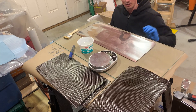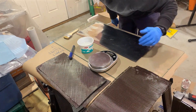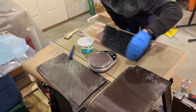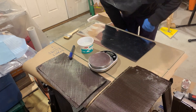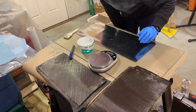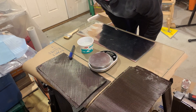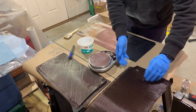We're going to do an 11-layer layout and try to make it quasi-isotropic. We've got five layers of plus or minus 45-degree bias — cut at 45 degrees — and then six layers of zero and 90-degree fabric. Basically we'll alternate a layer of each back and forth until we end up with one last layer of the bias, and then we're going to try to vacuum bag it with an Amazon storage bag.